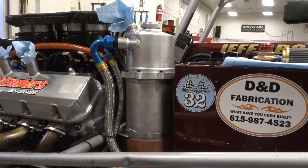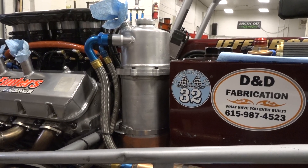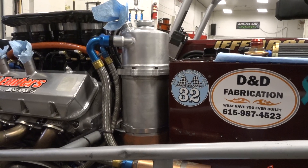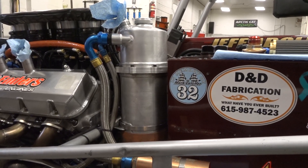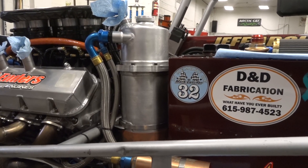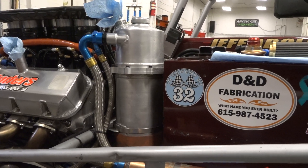Anywhere from 65% to 68% — our rule is actually maximum 68%. To get to that point, you have a lot of weight down this side, and then just packaging so you don't run lines everywhere. Some cars do run their oil tanks up front for weight balance, but most you'll see them right behind the engine or just in front of it.